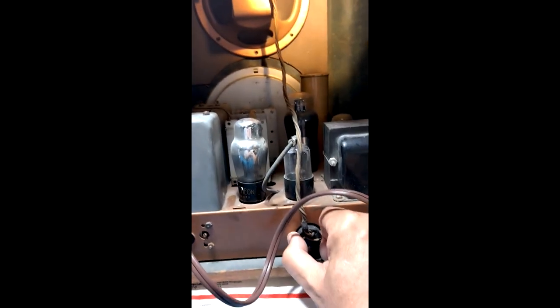This speaker is not an 8-ohm speaker — it's 1250 ohms. That 1250 ohms is the field coil, not the speaker cone itself. The speaker voice coil impedance could be 32 ohms, 60 ohms, 17 ohms — we don't know. You can't just use any speaker. The speaker is important for two reasons: it needs a field coil, and it has a resistance that doesn't match today's modern speakers.